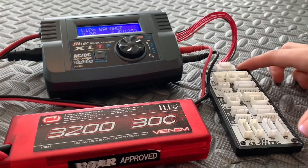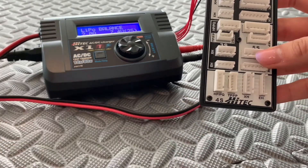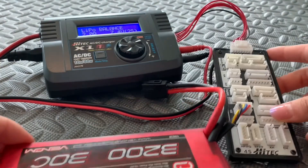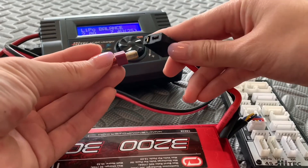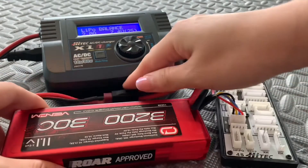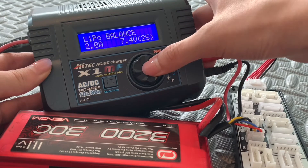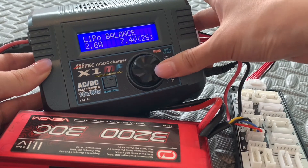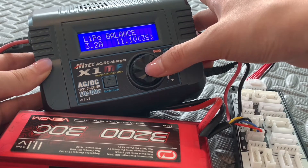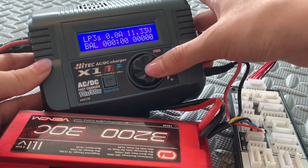Next, we need a LiPo battery that allows the pack to provide power to the Pixhawk board and motors. To charge the battery, first we need a balanced connector to monitor and charge the cells, and then the T-connector will be used to charge and discharge the battery. Change the setting of the charger depending on the specific battery you used, and be sure that you do not exceed the recommended charge current. Press and hold the start button, and then press the start button once again to begin charging your battery.